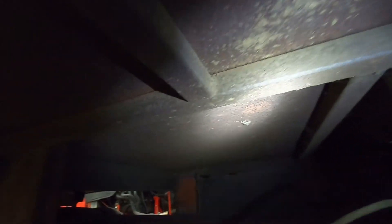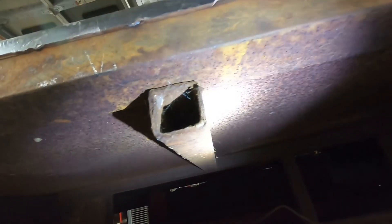A lot of material is not actually welded to anything. The other problem is when you look at the outrigger that comes out - this wasn't tied to anything, didn't have any structure coming down. It got a little weld right here - it's hard to see because it's filthy - but that's pretty much it, a little tack weld, and that's where you're going to have the actual load of the car sitting on top of. No wonder the sheet metal is bowing in so many places up top.